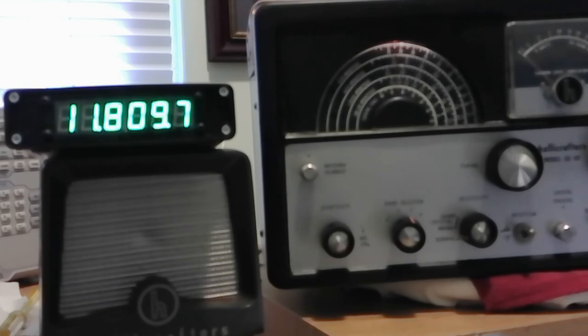through all the bands. Put it back together, had a hum. Oh no. So took the case back off, looked, couldn't find a hum. Okay, no hum with the case off. Then put the case back on, hum. And it turns out it's all in the audio output section, where the hum is or was. So maybe I have a bad tube. So I went to the 6SC7 audio amplifier tube. It's a dual triode, and it was barely seated in the socket.